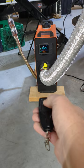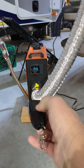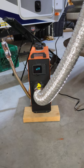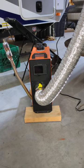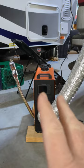So that's powered down. When you power it off, it tells you 'stop heating' — at this point don't unplug the unit yet. What it's doing is running everything out of the system and it takes about three minutes to fully shut down. You don't want to cut it short because it's burning off remaining fuel and doing its thing. It's smart to just let it do its work for about three minutes. At the end you'll hear it say something like 'thanks for visiting.'